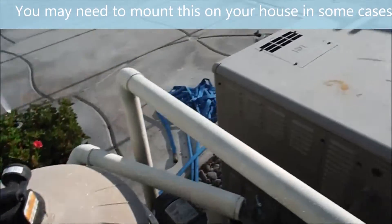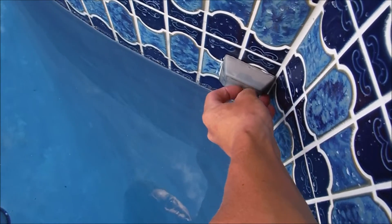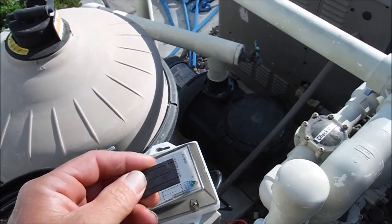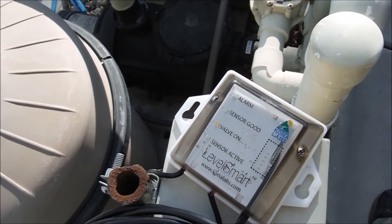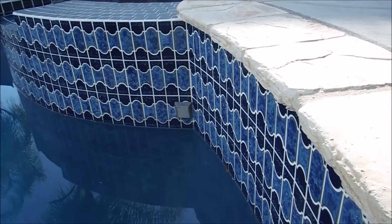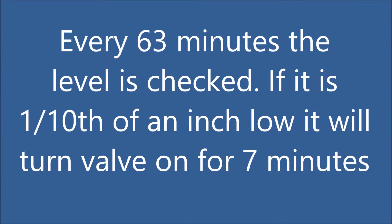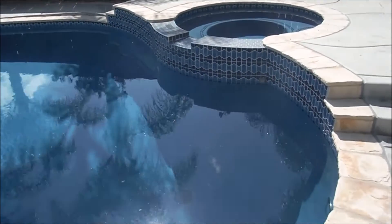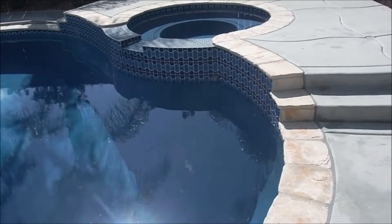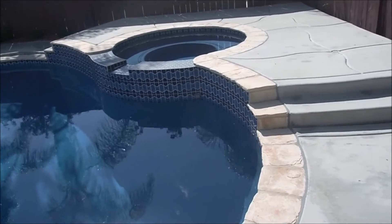The antenna here has to be in line of sight of the level sensor. By removing the magnet now while the water level is low, the water will fill up just to the lowest level on the sensor, and tomorrow I'll reset the water level. Keep the magnet because you can use it to reset both this device and the sensor if needed. I've got two green lights — everything is good. The sensor should tell the control unit that the water level is low, so it will turn on for seven minutes every hour. Back here the next day, you can see overnight it filled up to the bottom of the level sensor, which is what happens when it's not at the desired level — it stops at the bottom level. I'm going to add some water to raise it to the level I want and put the magnet back on to reset the unit.